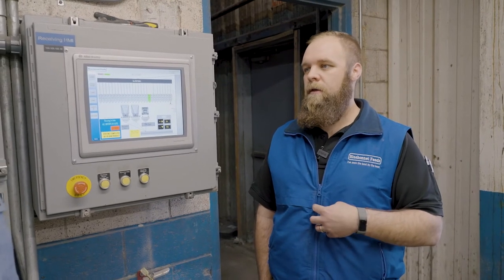We don't want to take the risk of their truck not being cleaned — they said they cleaned it, but we're cautious. Once everything's approved and we get it to the unload pit, we're looking for foreign material, pest contamination, things like that, and just overall quality. We run tests to make sure it's meeting our standards for protein, fat, fiber, moisture, things like that.